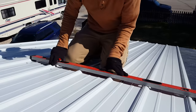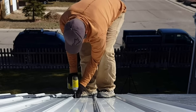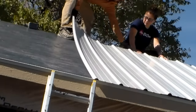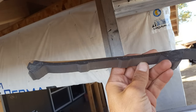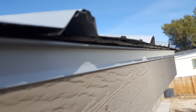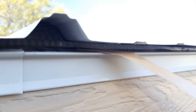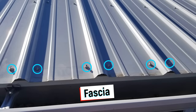Now that the first panel is secured, I can start on the second panel, again starting from the top and working my way to the bottom, but skipping the last row of screws. Then from this point on, I can just keep installing one panel at a time until I reach the other end. After getting multiple panels installed, it's now time to install the bottom inside panel gasket. This will seal all the small gaps at the bottom of the panels. These have an adhesive backing for self-sticking, but I wait to remove this backing until I wedge the gasket into position, which is about one inch from the edge of the roof. I found that if I try to install the gasket before laying down the panels, it doesn't always line up correctly with the ribs, causing a bad seal. Once I have the gasket in position, I then install the last row of screws at the end of the panels, and these screws should line up with the gasket under the panels.